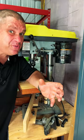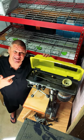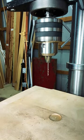I've got a gripe about drill presses, and my gripe has everything to do with the pulley system. How many of us actually get under the hood to change these things? Most of us are running our larger bits way too fast and our smaller bits way too slow.